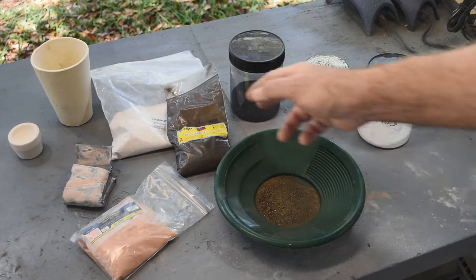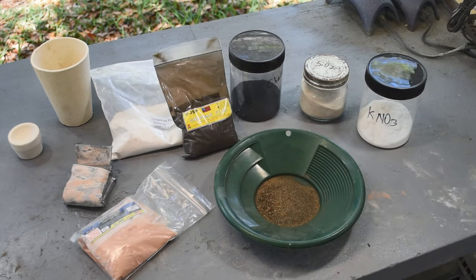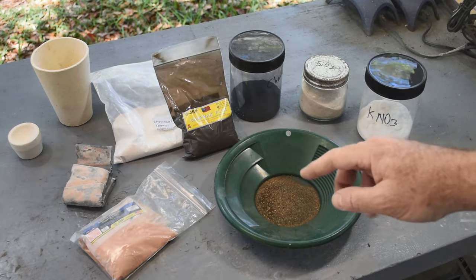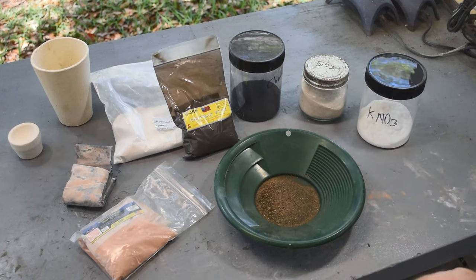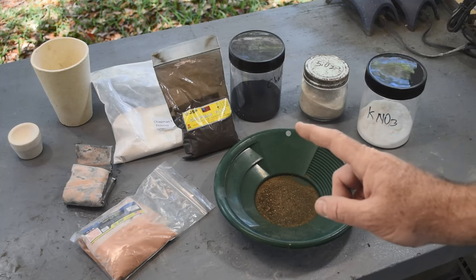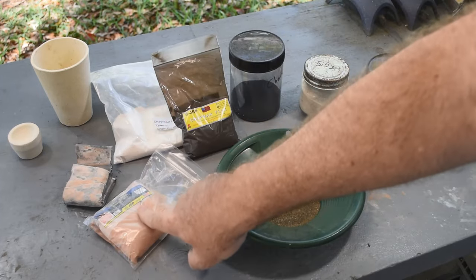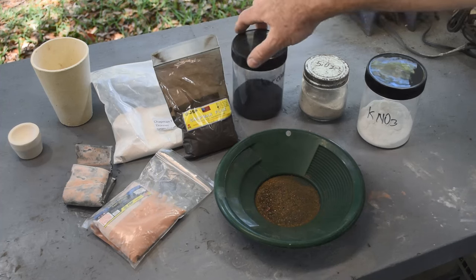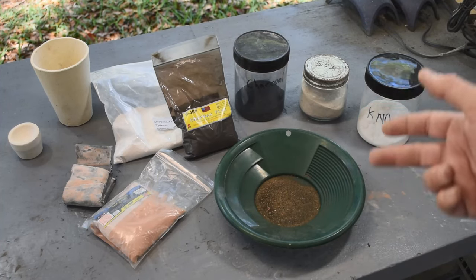Once we have oxides, we won't have to worry about a matte layer forming during the smelt — the flux will absorb all those oxides and the world will be a beautiful place. I'm not sure why Jason doesn't roast his ore; he's doing fairly large quantities which makes it difficult since you have to spread it out thin and heat it evenly. But that's what I'm going to do — roast this first and convert all the sulfides into oxides, then I don't think the flux will be that difficult to figure out.